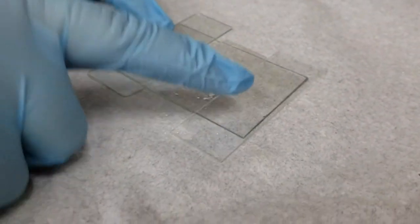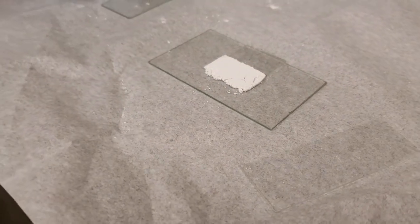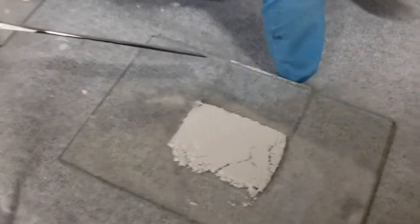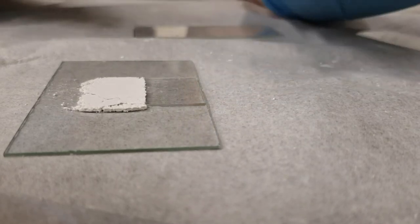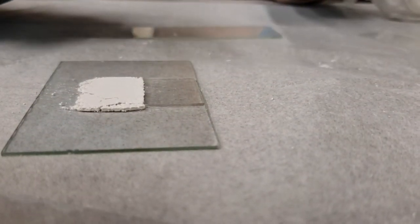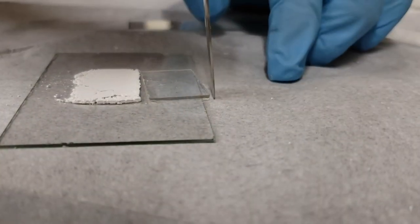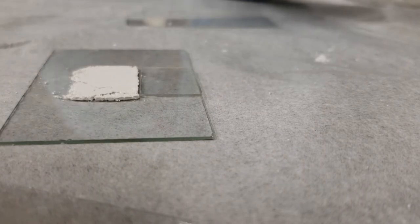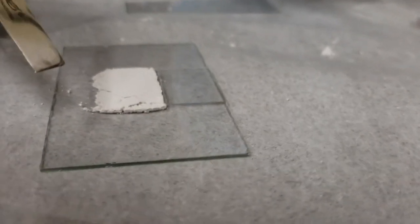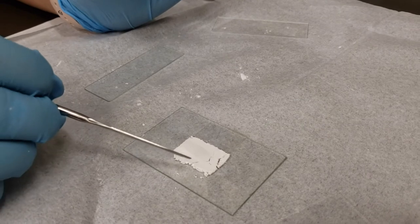Before we take this to the instrument, we are going to pull these two side glass slides off, but we are going to leave the spacer in place. I want to make sure that the spacer is even with the edge of the glass slide — I do not want the spacer sticking out, and I do not want it too far into the glass either. Unfortunately, mine had slid a little bit while I was sample prepping, so I am going to make sure it is just nice and even with the edge of the glass slide. Otherwise, your powder will not be centered in the machine itself. I am going to fix this up a little bit before I load it into the machine.